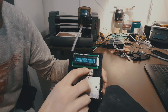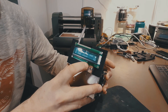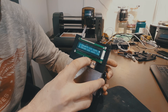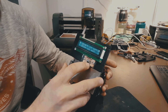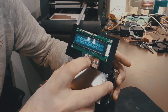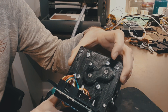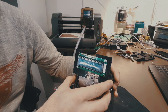I wanted to share some progress. Basically, you go down here in settings and set a place to start — this now turns — we press start, then we set a place for the camera to stop, press stop, and we set a time. We're going to choose one minute and press okay, then go to main menu, press start, and the camera turns back to the start position. Then we press okay and start counting the time where the camera turns little by little, moving from the start position to the end position within the specified time.